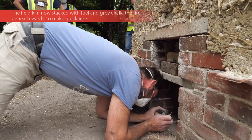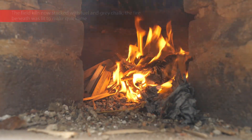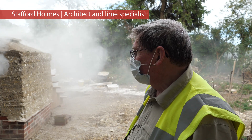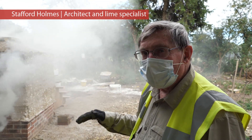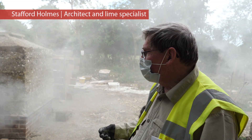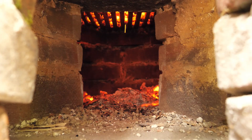There's plenty of paper in there. The kindling's alight. That'll be burning through and catching the main fuel, which is coke. The coke is layered in alternate layers with the grey chalk. As it burns through, it will heat up the grey chalk — it needs to reach 900 degrees centigrade. When it reaches that temperature, it will drive off the carbon dioxide and give us quicklime.